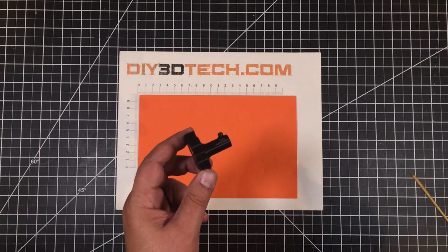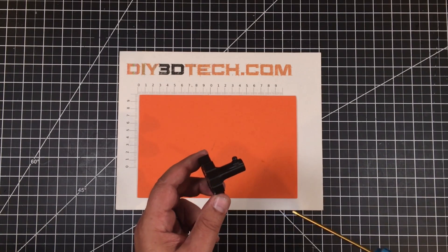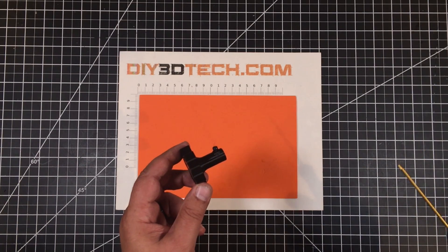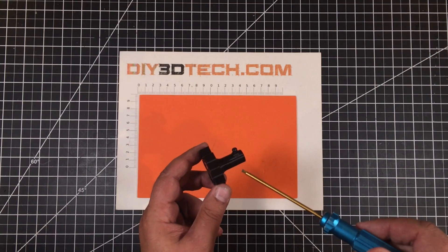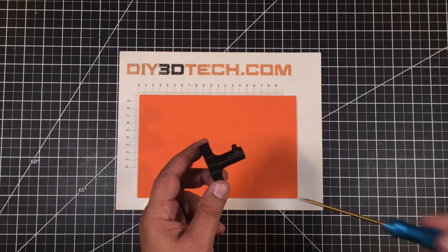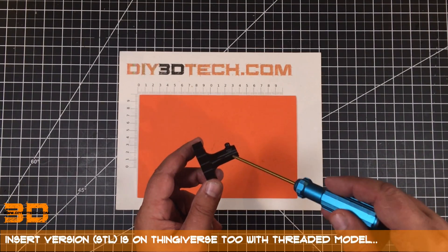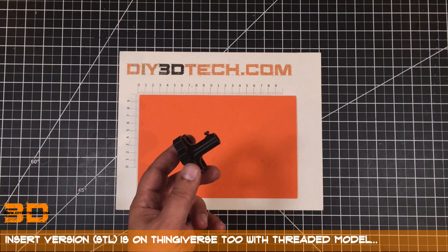It prints with no supports — that's what I think is kind of cool. One of the things I'm showing here in the Design Talk episode is 3D printing allows you some interesting modalities which other manufacturing means really don't offer you, and this is one of them. So I made this thicker here to receive the M3. You could also do an insert — there's enough body here to do a small insert if you wanted to. I've simply modeled the threads inside the plastic and it works just great.